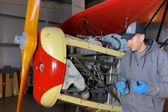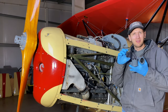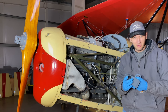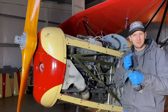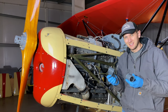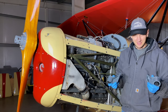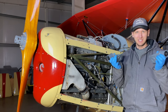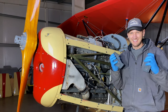Something we've been saving to the end because we weren't sure how easy or hard it would be — we got four new motor mounts. The motor mounts have rubber that is chemically bonded to a metal insert, which is pressed into the motor mount with a little lip around the top so the insert can't come out. But over time, the chemical bond separates and the rubber starts coming out. All of ours are currently okay, with one slightly sagging. There's really nobody that makes these new — they sold new old stock ones for a while but those are gone and were from the 1940s. There's really only one place that does it: Classic Aviation. They took the mounts, cleaned them up, repainted them, and put new inserts in for us. Great to work with — sent them right away. The inserts came straight from Germany, which is pretty cool.